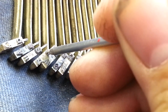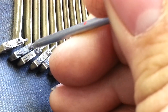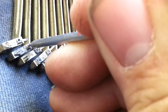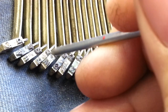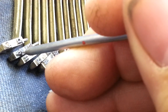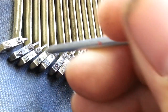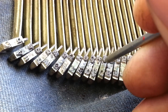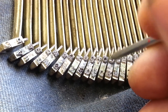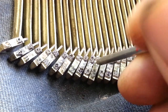I'm using this metal tip, and you don't have to worry about it scraping the typefaces. These are hardened steel — it's harder than the tip of this, so there's no way I'm going to be able to mar the typefaces. These are just way too strong. They're strong because in case they collide against each other they won't scar. That's why they're the toughest part of the typewriter — these little type slugs.